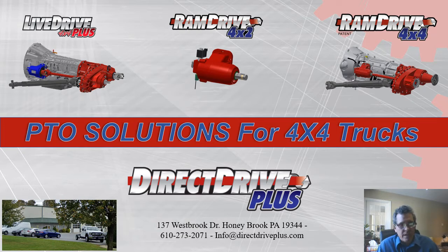One day while working under a 4x4 truck, Dwayne was struck by the idea of running a PTO shaft directly through the 4x4 transfer case. To test the idea, we purchased a transmission, a transfer case, sprockets, bearings, shafts, tubes, and a PTO to see what we could make of the idea. With several revisions we came up with a viable design, and in 2011 we built a demonstrator fire truck using our new design. It worked extremely well, and at the same time we realized that the idea was bigger than just the fire truck market.